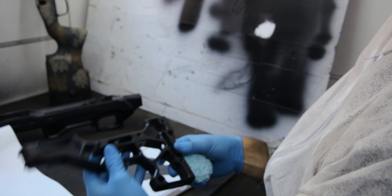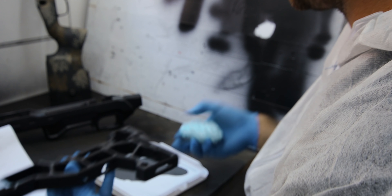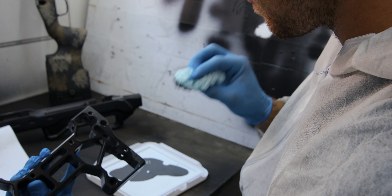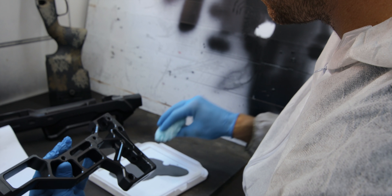What I'm going to do now is spray everything off with some potent acetone. That's going to get rid of any fine dust particles or a little bit of oil. Then we're going to bake it in the oven — just do that so any oil and stuff bakes up. If that is the case we're going to degrease it once again and put it back in the oven. So degreasing, let's go!